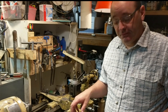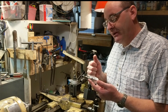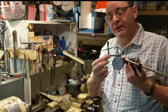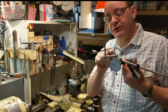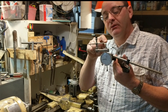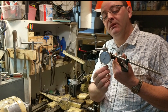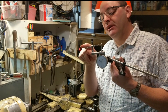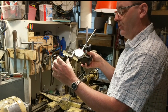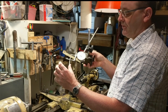Hello, and welcome back to the basement. A quick little video about this object right here. This is a Starrett hole adapter for an indicator. It changes the direction of travel that an indicator reads. So this indicator reads when this shaft goes in and out. With the hole adapter it changes that to a right angle so that the indicator can be put into a hole and read whatever shape is against this tip out here.